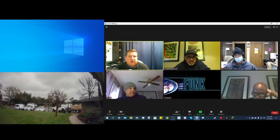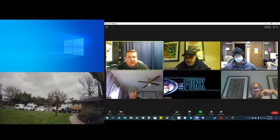And an example of where this is being used, by the way, Elk Grove School District made a decision, and it's probably been almost 6-7 years ago that they began this process, in restrooms in the schools where they used to have sheet vinyl. As they've replaced this vinyl and removed it out of the schools, they replaced it by removing all the glue and mastic off the floor, grinding the floor smooth, and then polishing that to achieve its gloss.